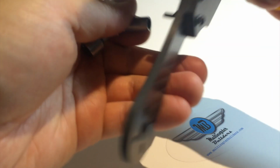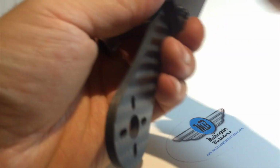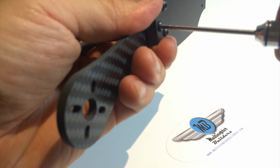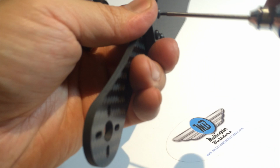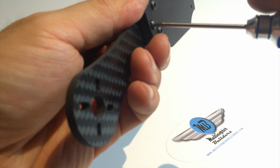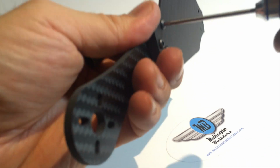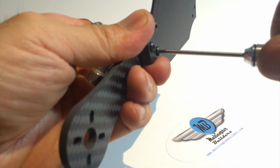We inch it a little bit more. We go down a little bit more. Then we go to that one a little bit more. And then we keep doing this, increasing pressure each time. And this way, you'll start to get a better distribution between each of them, and less likely that it's going to be crooked or it's going to have uneven amount of pressure warping the frame in some instances.